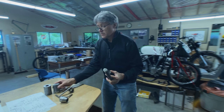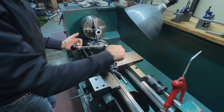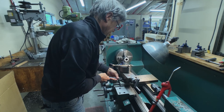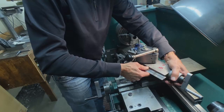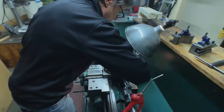That's our shaft. We'll go to the lathe with this one and we're going to make a taper. What we're going to do is move the compound. We have to loosen off the bolts or the nuts on either side and turn it at an angle. It's a 20 degree taper, so I'm going to get my protractor out and set it up. There's my 20 right there. I'm just eyeballing it — if it's off a degree, it's okay. I like that right there. Make it tight.